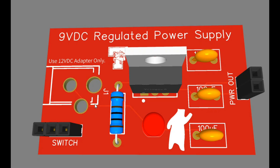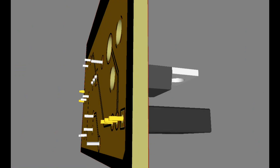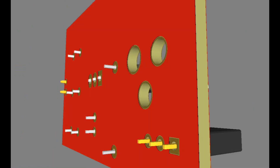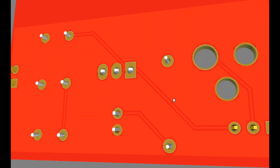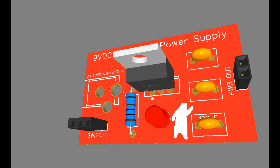Here is the layout of the board. We've got our barrel jack with the switch under it, our power LED here. We've added the new Toronto High School logo to all our boards from now on. We just line up our capacitors over here and shoot the power out the side. Here is a 3D look at the board — one thing you may not know about me is my goal to one day have all the 3D models for the components I use. Ground plane in the back. Very simple.